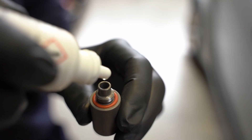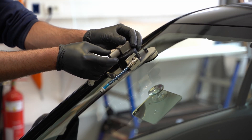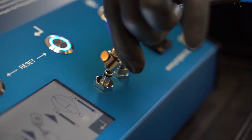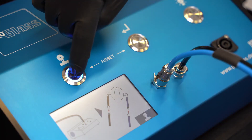Fill the resin tank with ProGlass repair resin VR505AF and confirm by pressing the enter button. Attach hoses and connect them to the Gecko and to the repair base. Then press the button to activate the pumps.